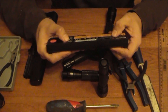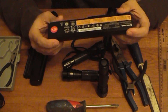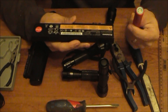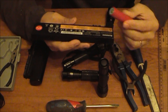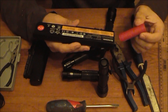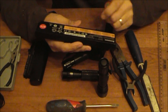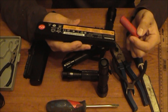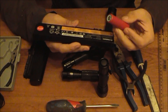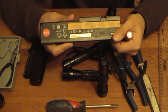Based on the fact that I think there are six cells in here and this battery pack runs at 11.1V, I'm expecting it to be three cells in series — nose to tail — to get from 3.7V to 11.1V, by two in parallel, which gives me the 5.6A. I can divide 11.1V by 3.7V to get three, confirming it's three serial. Dividing the amp hourage by two tells me the cells inside are probably around 2.8–2.9A — pretty good for a battery pack given to me free of charge.